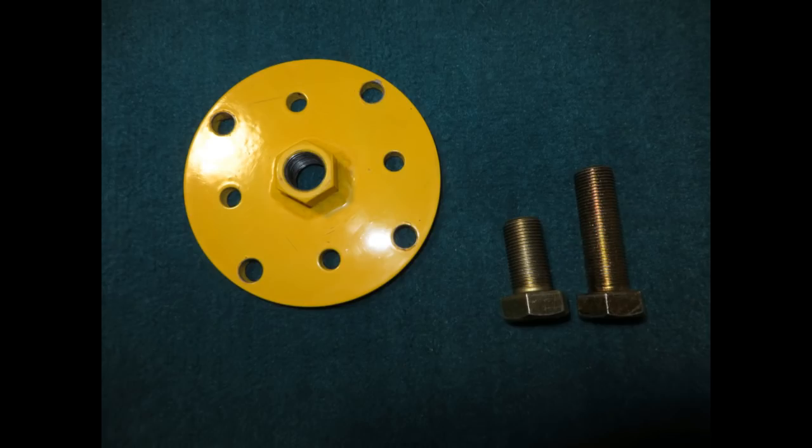Here's a look at our new TRD coupling removal press. This is machined from half-inch thick high-strength steel and has two bolt patterns — the standard four-inch BorgWarner style coupling and the five-inch coupling pattern. These ship with two press bolts, short and long, which should cover both V-drives and all conventional drives.